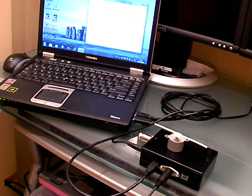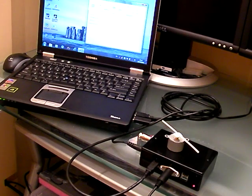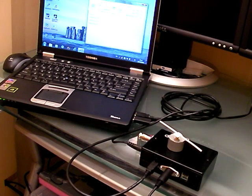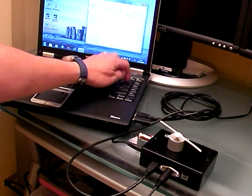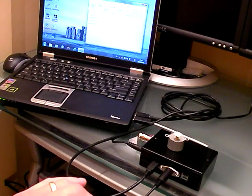Selecting the driver, it's got the usual properties box — max step, max increment, step size. Now we're under PC or manual control. I'll set it to 100 steps and hit the right button, again and again, then left, then left again. Reducing the steps to 10, you can see it's moving by maybe four or five millimetres and back in the opposite direction. Making the step size very large — say 200 — hit right, then left. And notice we still have manual focus control as well.